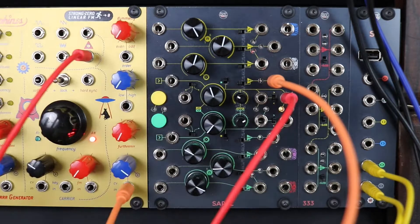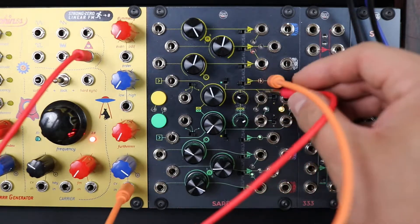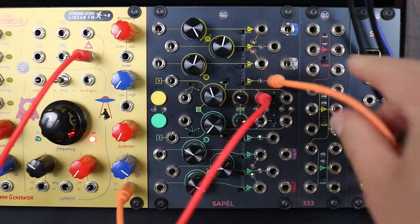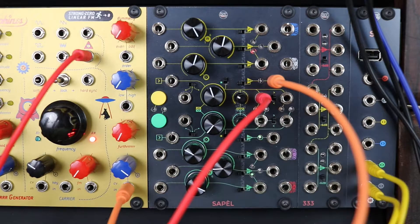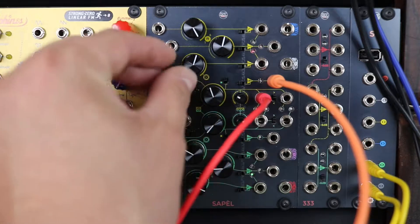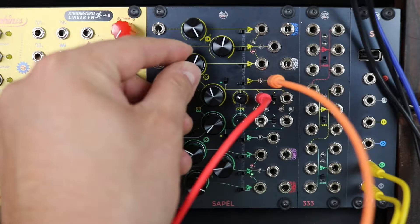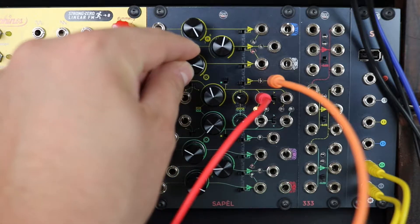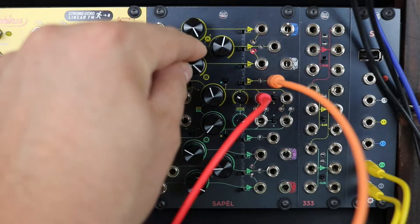This module also features two circuits for random clock generation, two for each section. These are accessible via the socket on the left of the normal clock output. The switch lets you choose between the two circuits. If it's up, it works in additive or 'more than' mode, outputting all the clock generated in addition to other random clocks, whose time density depends on the global rate of change of the fluctuating random voltage. As you increase its value, density increases too, while still being random.